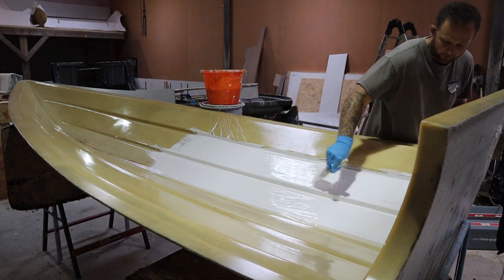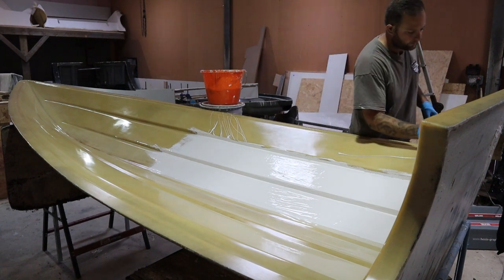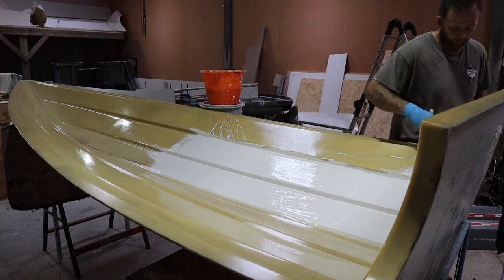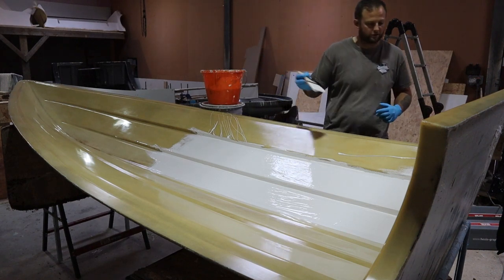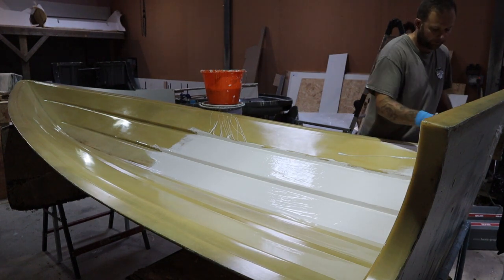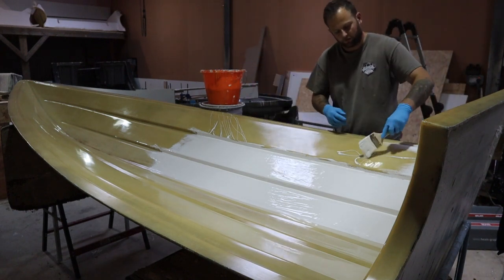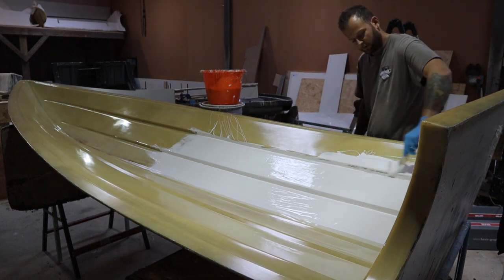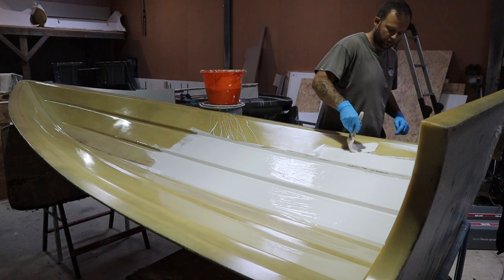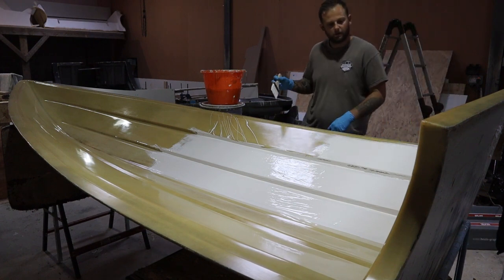At the end of the day, we are working with chemicals, and there are some things that can happen that you don't account for, and it might not always be your fault. It could be that the mould got knocked, or the exothermic reaction cured a little bit too quickly and there's a little bit of shrinkage. You really don't want to be moving the mould around once this is done, because it might pre-release, as it's quite a thin mould. You don't want to knock something and have the boat pre-release out of the mould, and then when you put the main layup in, it causes more problems, because the gel and first layer of fibreglass has detached from the mould, then warps, and evidently causes you more problems down the line.